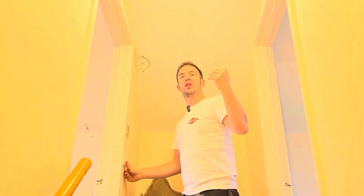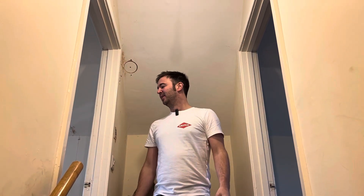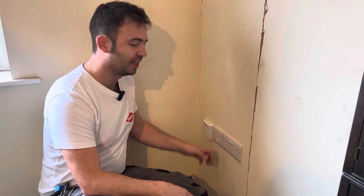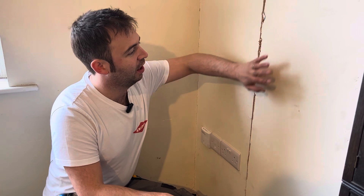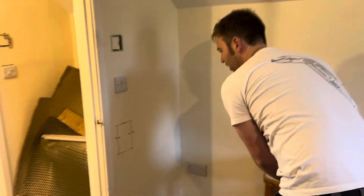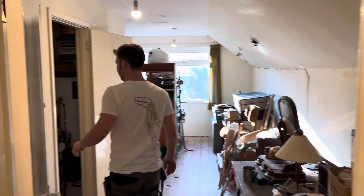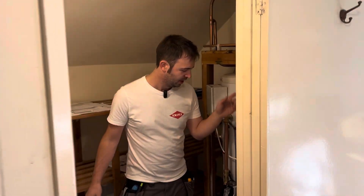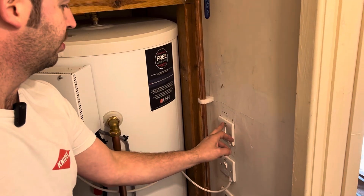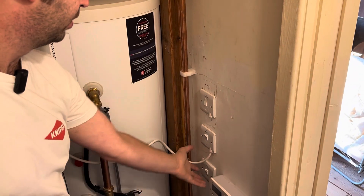Upstairs was a bit more awkward — we had the eaves to run the full length of the house. It was actually quite challenging getting the cables from the eaves inwards. Here's our incoming phone supply, and the other end of the Cat6 from the lounge is here — when they get a router, plug it in, Cat6 from here down to the TV or an access point. I cut in an access to the eaves for running our cabling. All the patches have been filled back in. There's another storage heater, a light switch, an immersion heater supply — a dedicated 20-amp radial — plus a pump circuit and a thermal solar supply for the future.